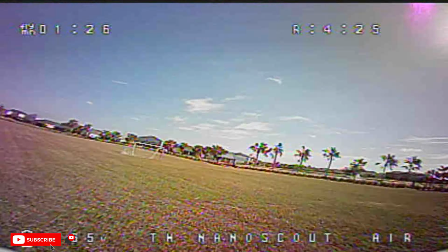Now, the one issue I did have on this, and you can see it in the first video, is on my first two flights, I was unable to record my flight only because the DVR kind of froze up. I did hit the record button on this, and it really didn't record. Now, this is not a new issue for these box style goggles. In fact, most of the box style goggles on the market have the same kind of firmware or components.